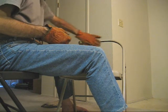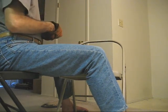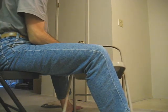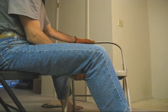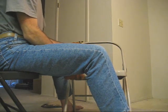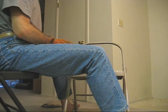I take some solvent, some paint thinner, and clean the back of the chair because there's all this bare metal exposed. And then I paint it. This chair is a folding metal chair I got at Staples — it's Miko brand, which is a good brand because they don't have a crossbar between the front legs, and that's helpful for some yoga poses. It's buff in color, and I've found that Krylon Fusion brand paint in the River Rock color is a good match for this beige buff color. It also does not require a primer, so that's been a very workable solution. So that's how you make a yoga chair. After you paint it, you just let it dry for about a day, and you're done.